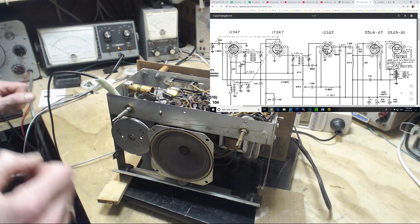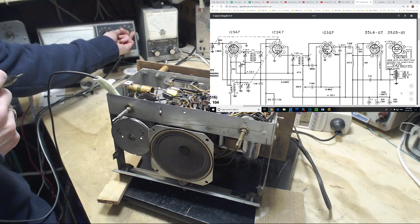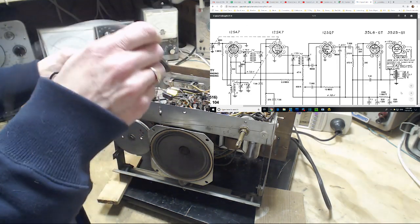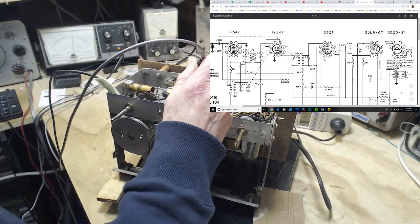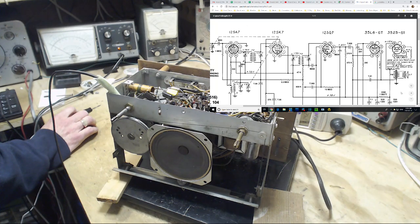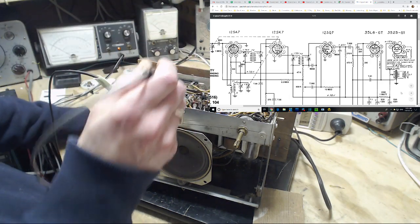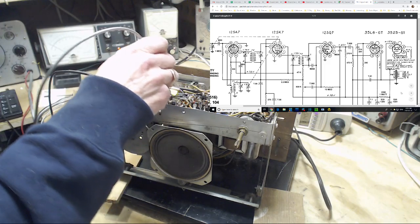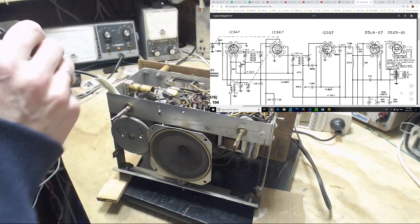Plate voltage should be 78 volts. 12SA7 is this tube. And the number is pin 3, 78 volts. Pin 3, and 1, 2, 3. And that's reading 90 volts. And there is also pin number 6, screen in the tube. 1, 2, 3, 4, 5, 6. Should get a similar sort of deal there. Come on. Reading a 0. Okay, what did I do wrong?